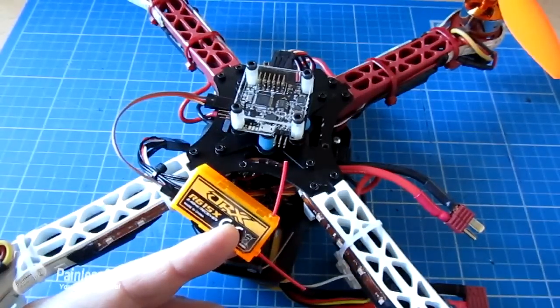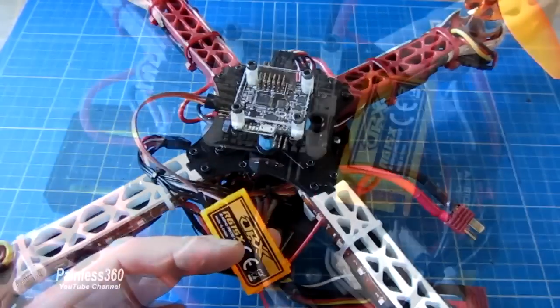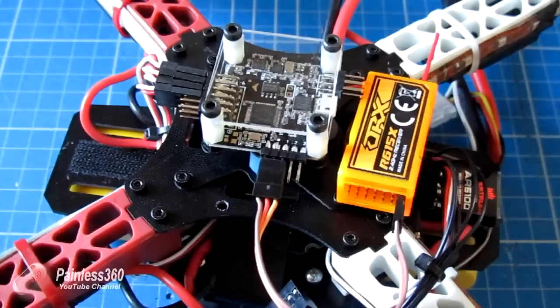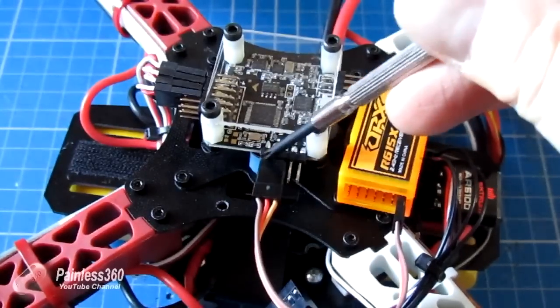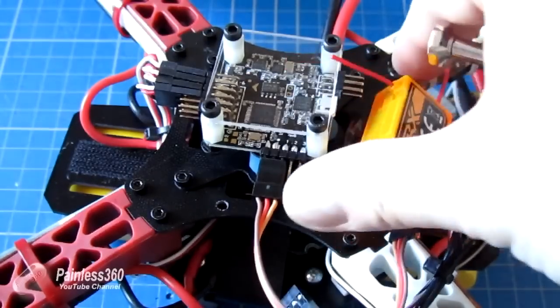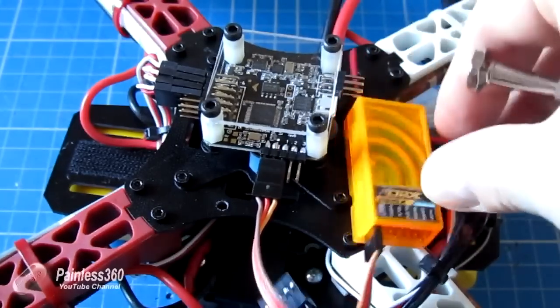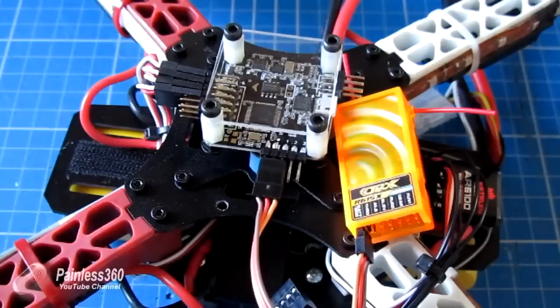The first thing we need to do is actually install the receiver. We've done that here — let me zoom in and show you. Here we are looking at the side of the board. Here is how we plug in the CPPM cable into pins one, two and three, so we get ground, plus five volts, and one signal wire. On the R615X — a Hobby King receiver — the battery bind port is the one that pumps out all of the channels in sequence down the single signal wire. We need to change this cabling over, and then go into CleanFlight and change a setting so the receiver knows what it's looking at.